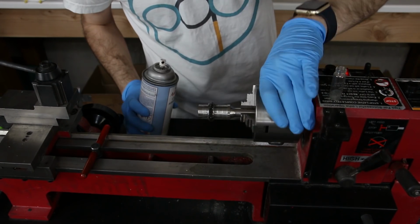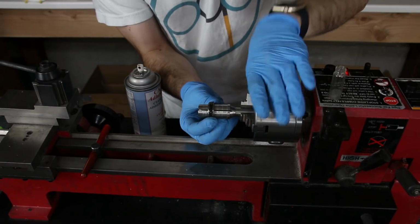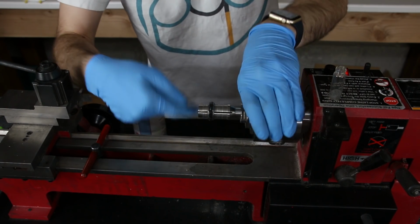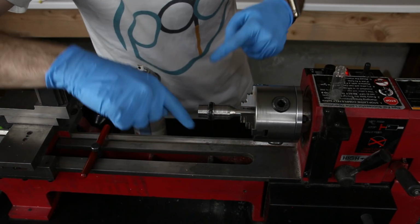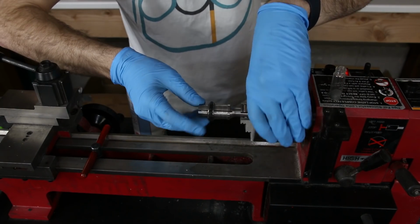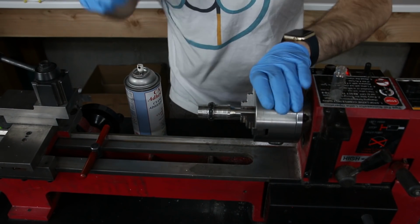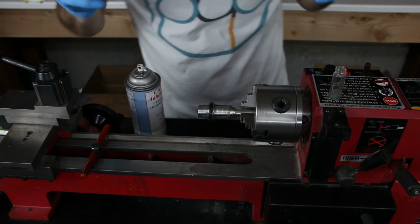And then a big thing to know, especially if you're new to ring making: if you didn't fully cure the super glue throughout your process, you might have it hardened on the outside, but there might be a wet pocket of super glue on the inside. And what sucks is if you're grinding into that with a Dremel, it will whip around super fast and it can spray wet super glue all over. So especially if you're starting out, always be sure to wear a face shield. That way you don't have to worry about anything, including super glue, spraying around like that.